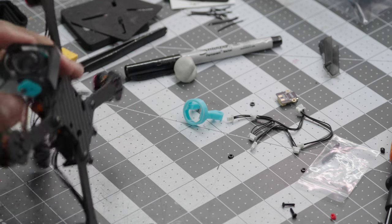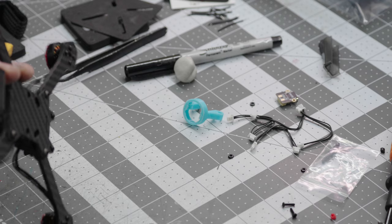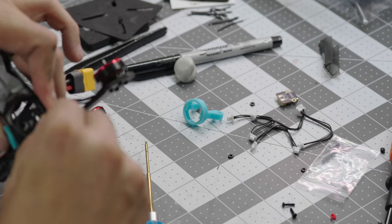Move the camera mount pieces out of the way, bring the camera over the top — make sure you mount it the right side up so you can read DJI — and it's going to go right in that hole. Use those two little M2 by 7 screws we took from the motors. Once you feel it reach threads you can just thread it in. There you go — a fully mounted O3 air unit.